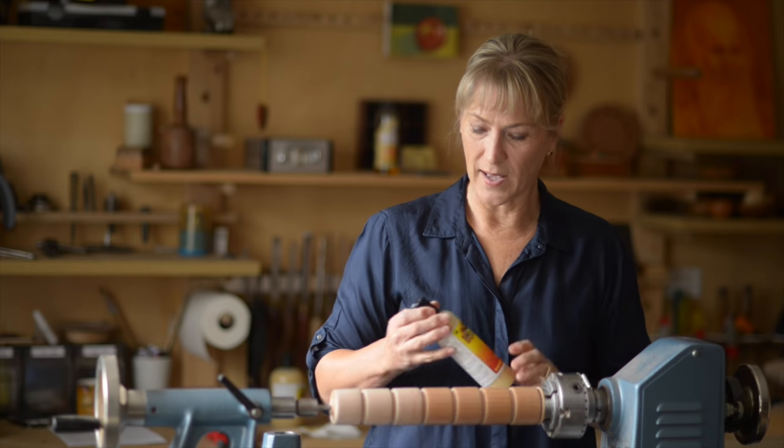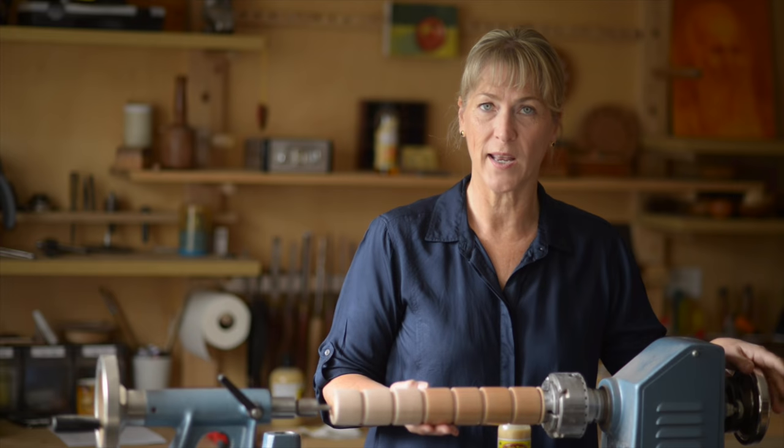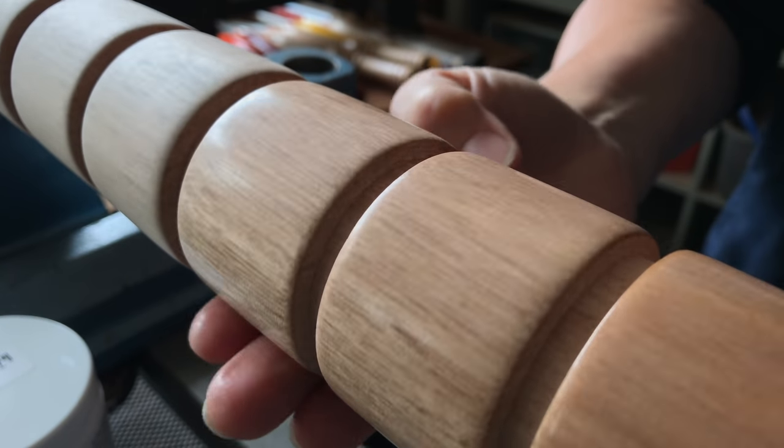On this segment I experimented with Triple E and then applied the Shellawax over it, and it's given a lovely sheen but also provided a coating. So if you want that raw wood feel but with a bit of sheen, the Shellawax is a perfect finish. The advantage is that you get the same appearance in the finish but you get the feel of the wood and the wood grain — it's much more tactile. It's only one application, so it saves time and it's very easy to work with.